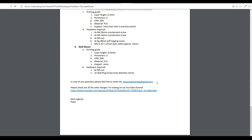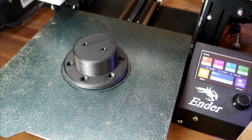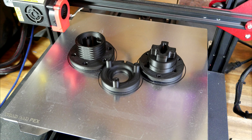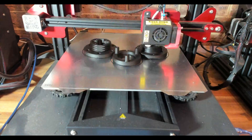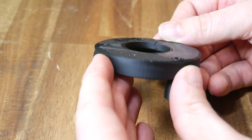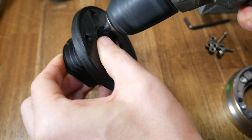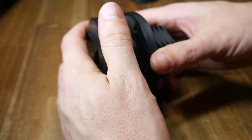Down the bottom there was also the offer of technical support if I got stuck. So I fired up my printers, making the base adapter ring from PETG and the rest from black PLA, including the optional wall mount, spacer shims, and the actual adapter parts. For those important pieces, I confess I spent more time setting up a new Pi 4 with Octoprint than cleaning the bed, and I stuffed up the Octolapse anyway. A dusty bed combined with a really cold overnight print meant the edges peeled up from the bed and distorted quite badly, so I had to drill out the printed holes and spend time with the Dremel tool cleaning up the mating surfaces until they finally slotted together nicely.